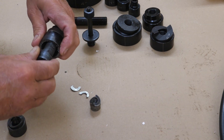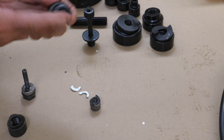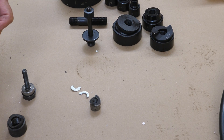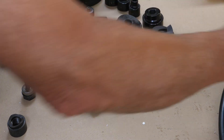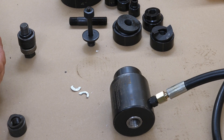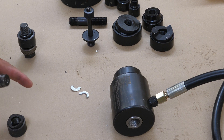The way we used to do this a lot was to put a one inch socket and a ratchet on there and crank it down to punch your hole. Having a hydraulic unit makes it a lot easier and a lot quicker. Once in a while you'll have a place where you can't get this big head in and you'll have to go back to the old fashioned way, but I did this for years. We'll get on to demonstrating how this works exactly.